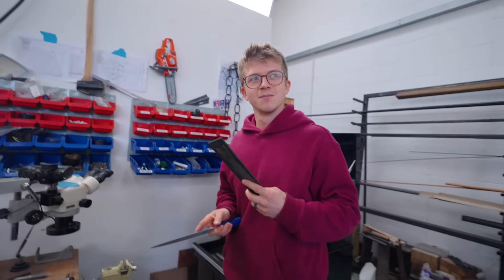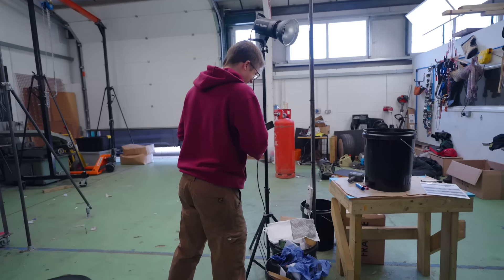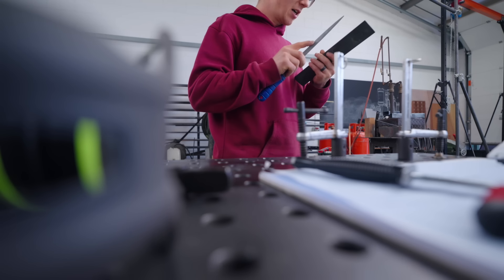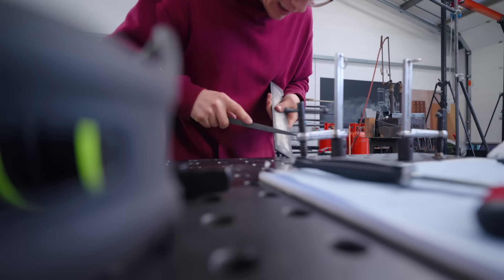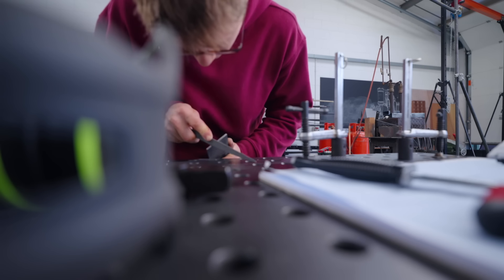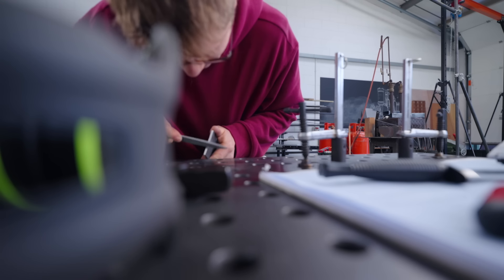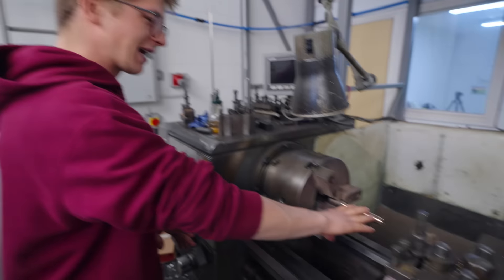It's not hard at all — is this a bit of mild steel? It's meant to be hard but it's not hard. I am concerned it does not feel like it's hardened — this is meant to get to like 60 Rockwell. Oh, that feels a lot harder. That's hard as nails now. We've got the sucker in the tempering oven, and now we're going to get back to the handle.